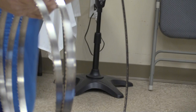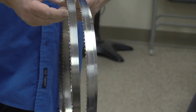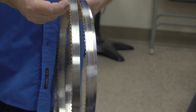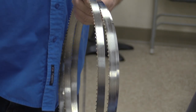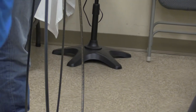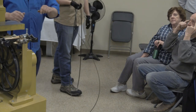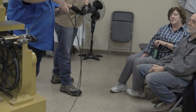The deeper part of this blade in between the two points is called the gullet. When you get ready to put the blade on, you want to have the wheel lined up so the gullet is centered on the wheel — not the flat part of the blade. So when they say to put the blade on the center of the wheel, they're talking about where the gullet is in the center, not the flat blade. That way the teeth are not actually touching the wheel.